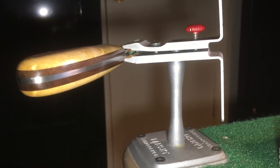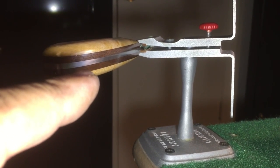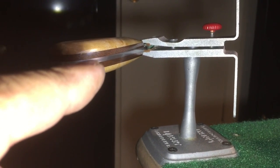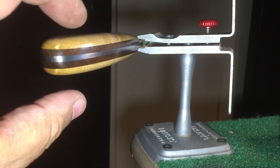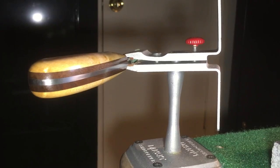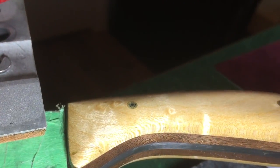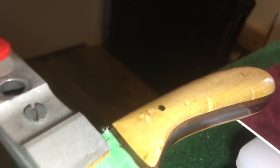I love those walnut liners — I'm glad I did that. A lot of work, because you have three surfaces you have to sand completely flat: the inside of both walnut pieces, the outside of both walnut pieces, and the inside of the bird's eye maple. They all have to be 100% flat so when you epoxy them together there are no gaps at the edge. Those mosaic pins — I'm digging them. That bird's eye sure does pop. Thanks Ricky for giving me that — that's some good-looking stuff.